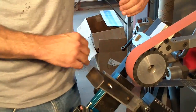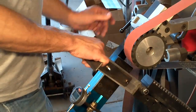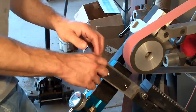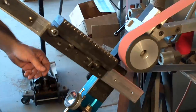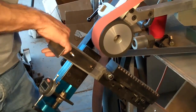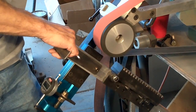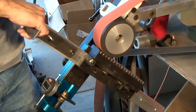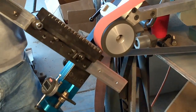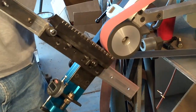I'm just going to track my belt over and back and expose more belt with this 100-grit belt, and then I'm going to go to a 220 to finish my table surface. This is much like moving a stone across — we're just moving the belt across.